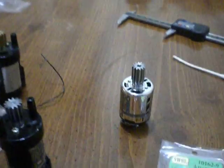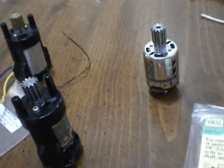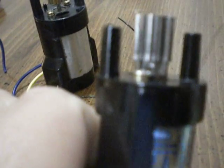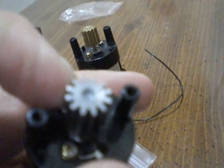The most tricky thing about it is putting the adapter bushing and gluing it on there at the right height. Be careful not to use too much glue — you don't want to get it on the outside of your adapter bushing or down in your motor. I messed up one adapter bushing because of this. You don't want to tighten your set screws at all until your JB Weld at the top is dry. That's when you tighten it down — that's when you'll get the true tightening of your shaft to your pinion.